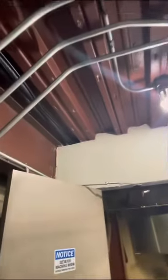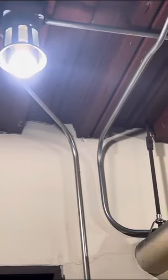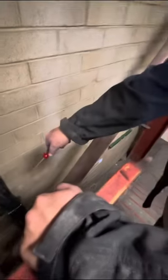One thing you gotta remember is these rooms are basically fire rated. So you see how this roof is drywalled all the way to the top. What we did is we cut out that little notch to run all our pipes, but we're gonna have to fire stop that, okay? And then we went right here, down and out right down there. And there's another one that's gonna go over there.